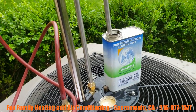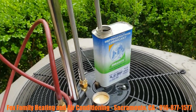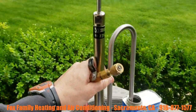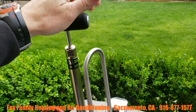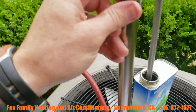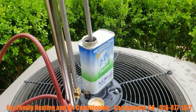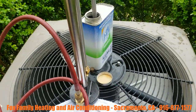Okay guys, we're gonna pump some POE oil into this R22 system that utilizes mineral oil as its lubricant. We changed the evaporator coil just now and so we're charging it up with 407C and we're gonna add some of this POE oil into it. I went out and got the Yellow Jacket pump for this — basically as you lift up on this it's gonna siphon in through here into the pump, and as you push down it's gonna pump out through the red hose and into the system. The Yellow Jacket pump is made so that you can pump the oil into the system while it's running. We're gonna show you guys how to do it right now.